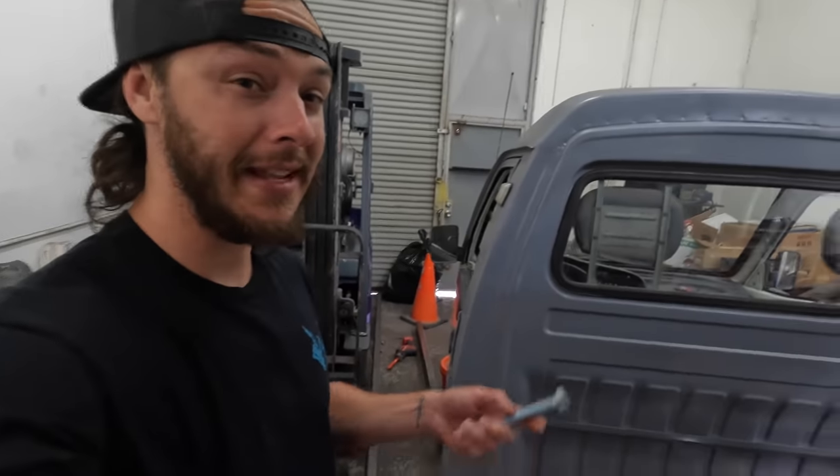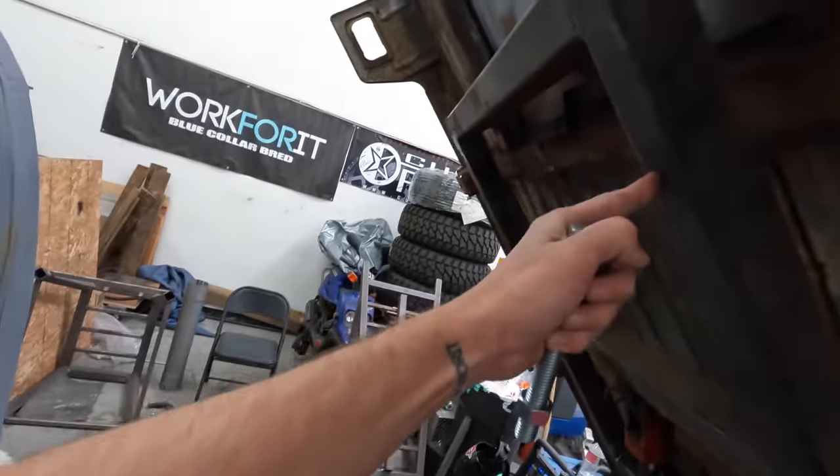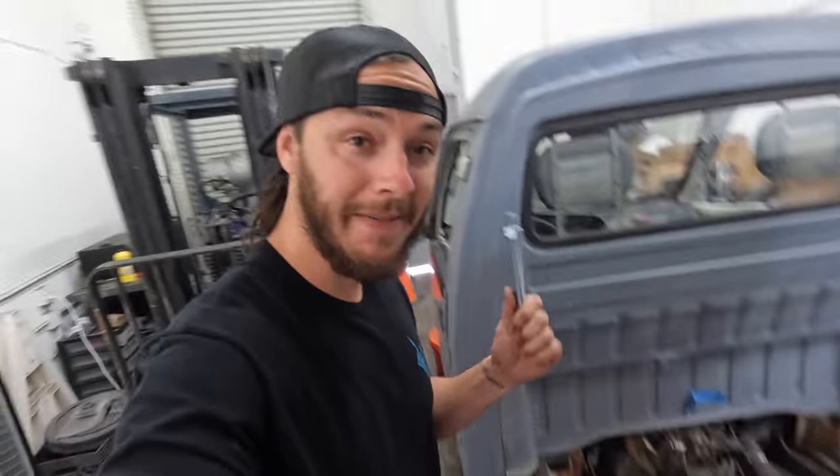Okay, so I just made a quick trip to Home Depot here. And unfortunately, they didn't have a clevis pin that's long enough to not only get through that and our spacer, but we also got to get through that 2 inches. So it ends up being just about 6 inches is what you need. So for now, we're going to use some 5/8 bolts here. Went 5/8 because that's obviously the same thickness as a clevis pin that we'd be putting through here. So if I find a 6-inch one later, we don't need the nut and the bolt. But for now, this should be just fine for testing. Plus the hole will already be the right size for a clevis pin.